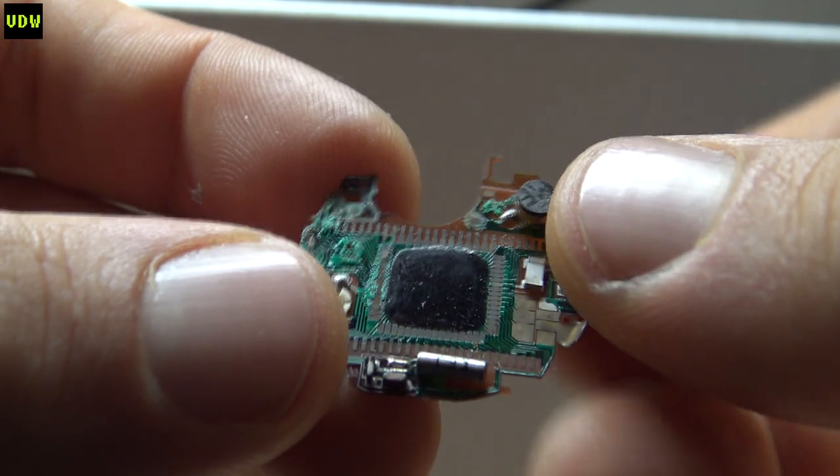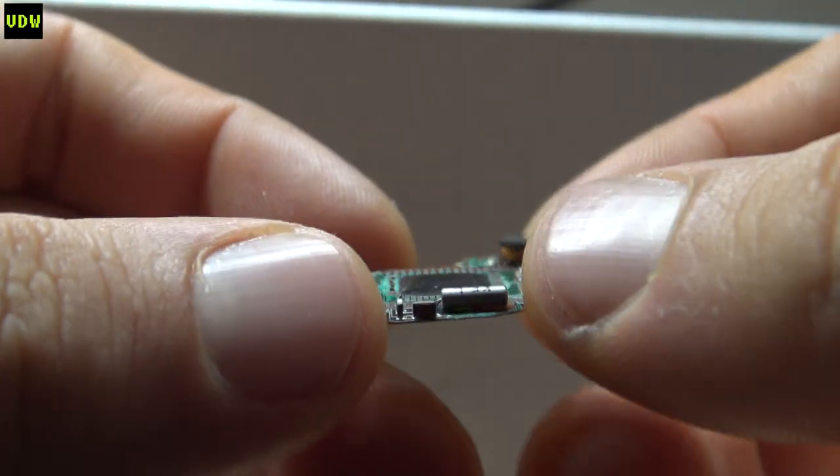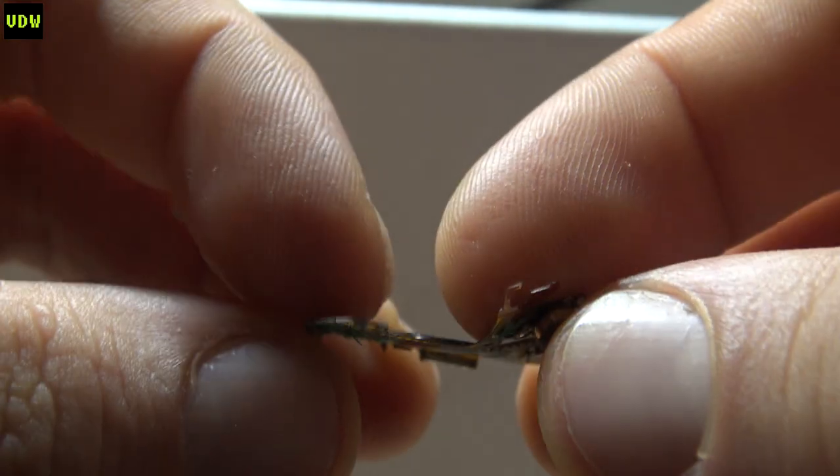Number three: some of these have a film PCB - it's not like a regular backlight board, it's printed on a film. And even more so, some of them have a floating integrated circuit, so if corrosion happens they are super difficult to fix. There's nothing you can really do about this - if you buy one and it's corroded, then tough luck - but it's just something to be aware of.